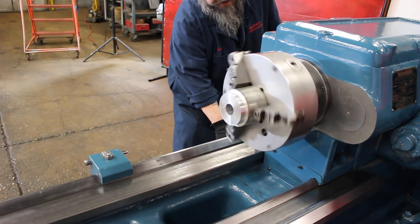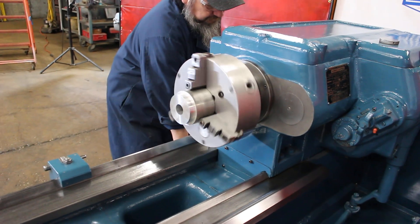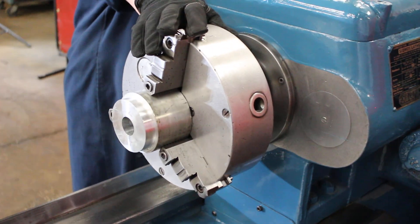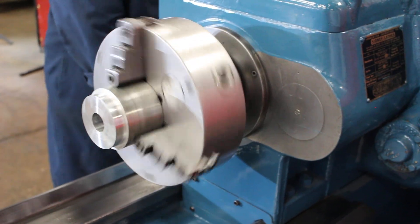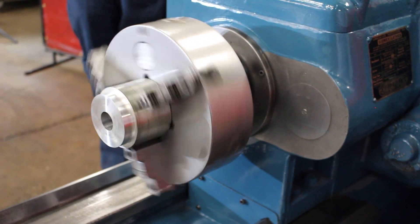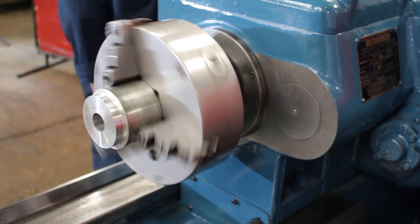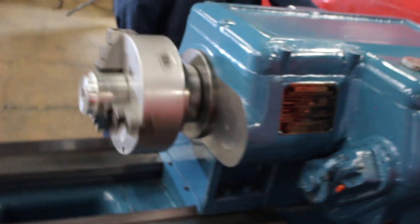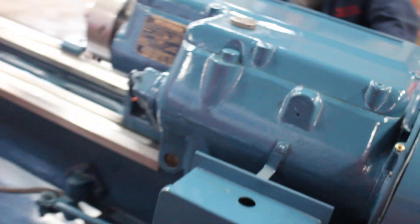Let's talk about this three-jaw. It has two-piece top reversible jaws. It has a real nice stamp in it — the stamp reflects a symbol, then it says 9-S, as in Sam, dash 36. It's 1 and 5/8 inches on the spindle bore. Currently at 64 RPM.